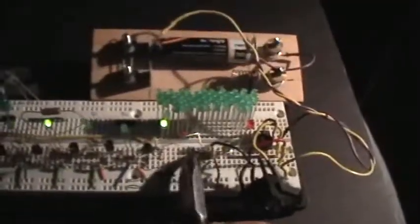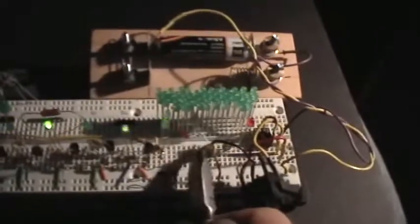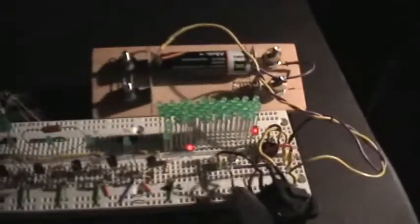I'll put the bank of LEDs back together — reconnect them rather — and disconnect the ring oscillator part. You can see that all those LEDs are glowing. Let's tweak the base resistor a little bit. Going good there. So that's on less than one volt input — that's a whole bunch of LEDs. But I think the ring oscillator is actually more dramatic; I like the ring oscillator.